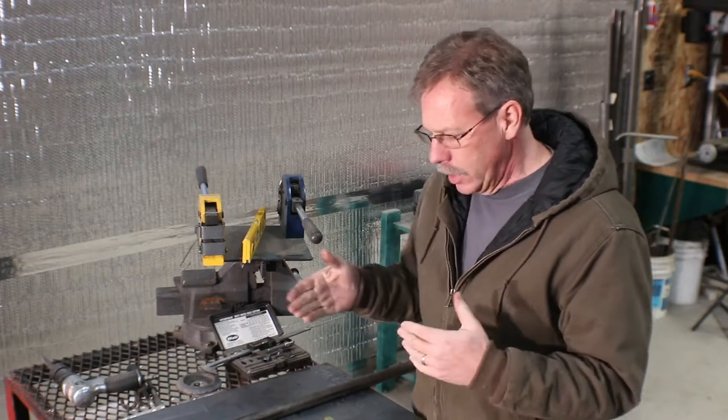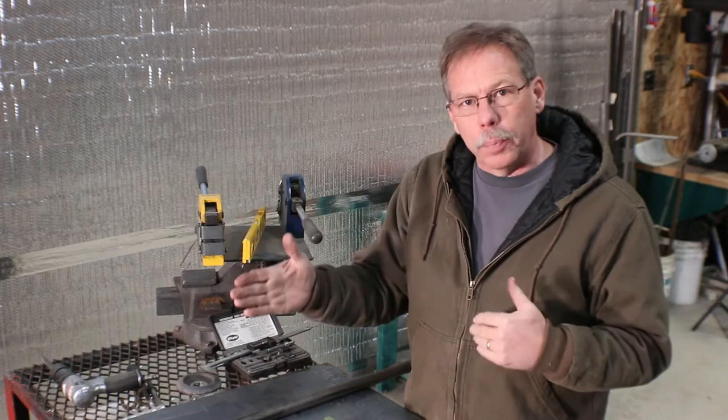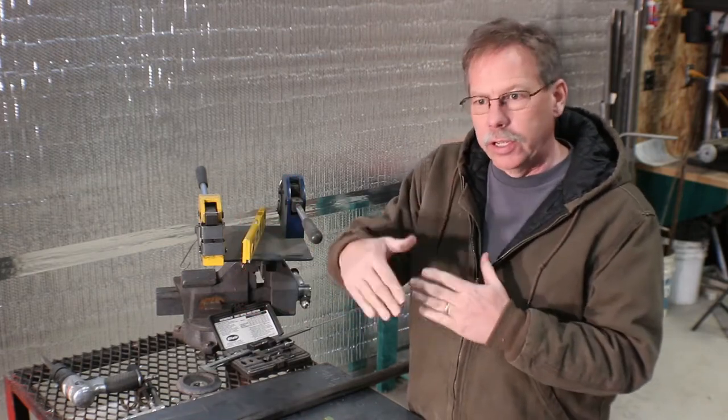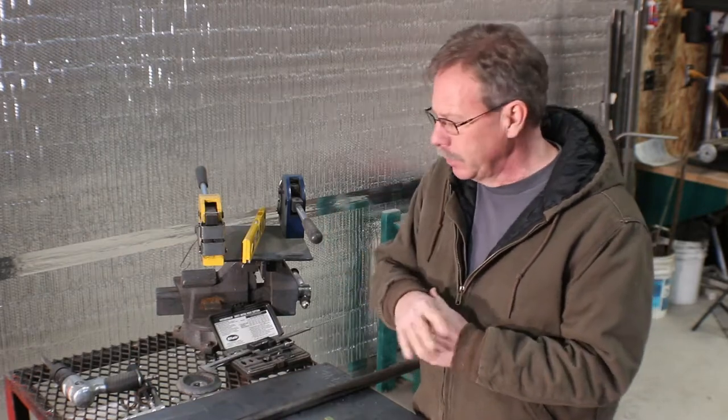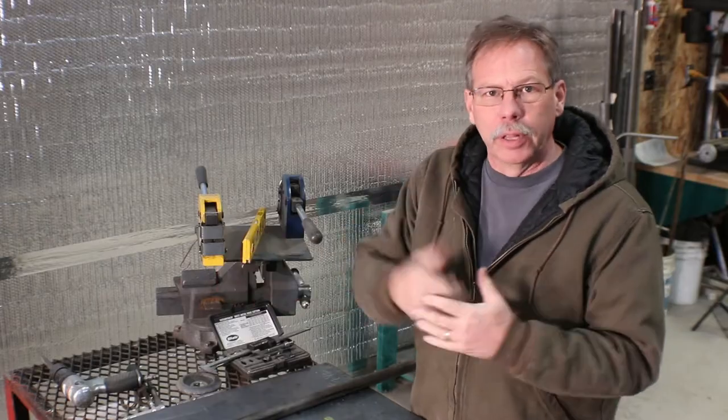And then the other thing we're gonna do is, it's not just gonna be a straight barrel hinge, you know, it'd be way too simple. I'm gonna make it to where the gate wants to stay open, so we're going to put a slope in the hinge where the top half and the bottom half meet, so that the gate will always want to swing to the open position and you'll be locking it closed.